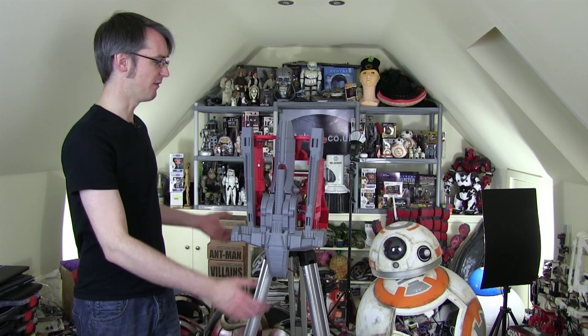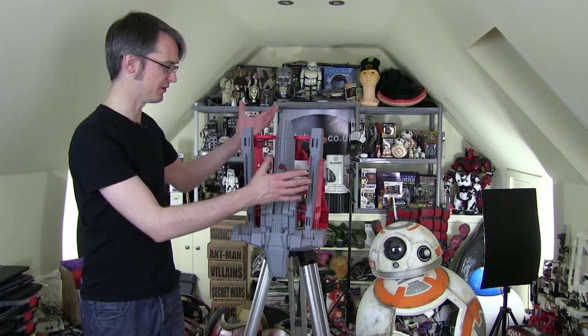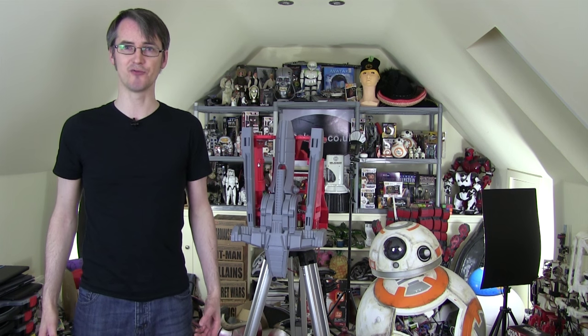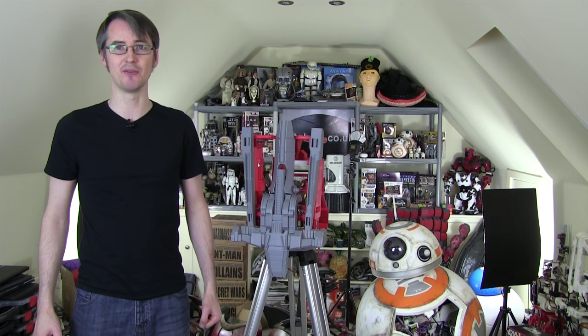This is as far as I've got with Ultron so far. We've built basically the lower torso with some actuators in, and we'll have a closer look in a moment. I also last time worked on some of the cosmetic pieces, so this is going to be highly detailed. It's 3D printed, partly in ABS rigid plastic, and also in NinjaFlex, which is a rubber-like material, so I can have all sorts of biologically inspired flexible pieces.